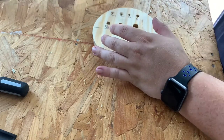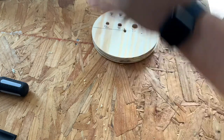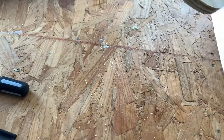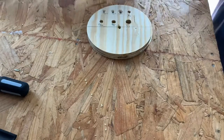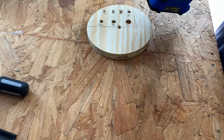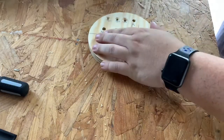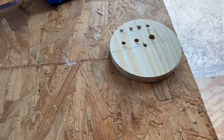I don't know if I'm going to be using these or the countersinks that are actually attached to drill bits. Let's go to the 3/16. Not liking that. Let's move it up — I doubt it's going to matter, but let's bring it up to its full potential. It is getting rather warm. Bring it up to 2,000 RPMs. You know what, it was already getting hard, so let's turn this and clamp this down.